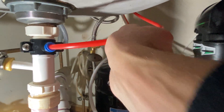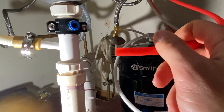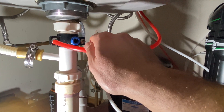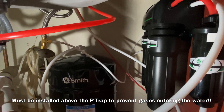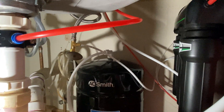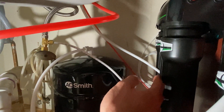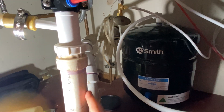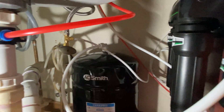You may ask yourself what is this right here — why is it going into the drain? This is called the waste line. When you install a reverse osmosis system, you're always going to see this. Every reverse osmosis system will work the same, but they may look a little different — the filters may be different, more or less — but they're all going to have this. When the fresh water comes from the city supply line, it's going to get filtered, but the dirty water is going to get dropped right into the drain. Some very expensive reverse osmosis systems will not dump it down the drain but actually refilter it, recycling the water. Most systems will dump it down the drain.